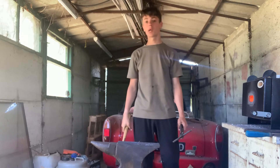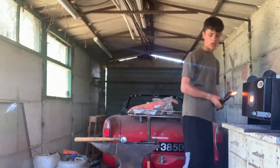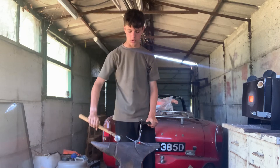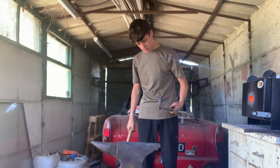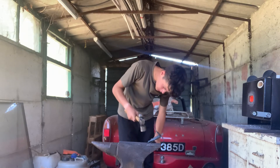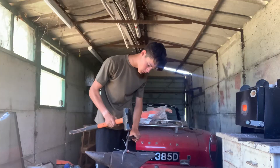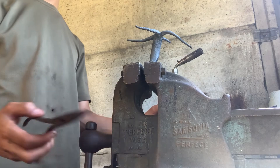It's cold and it's doing neither the workplace nor my sanity any favours, so I'm putting it back in the fire. This is hot again, I'm gonna put it down and carry on working. I'm just gonna try and knock that plug out now — gentle persuasion with a hammer. There we go — there's a hole, not the best, might go in with a round file and clean it up. I'm gonna heat these up with the torch and bend them.